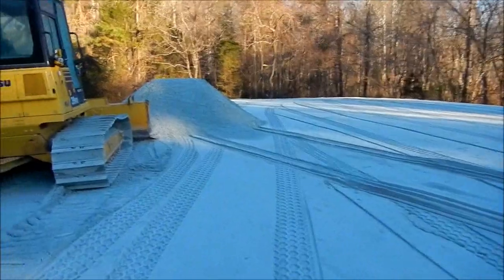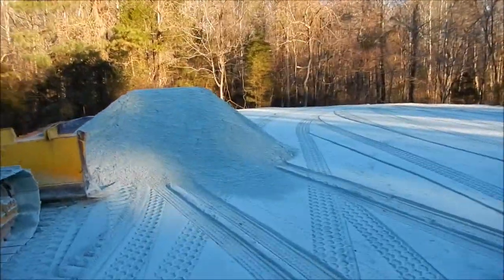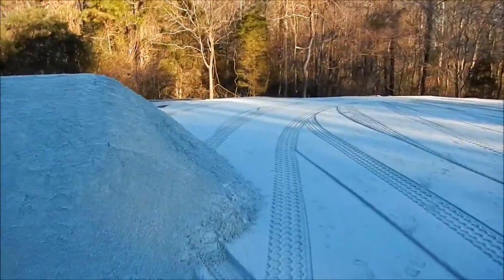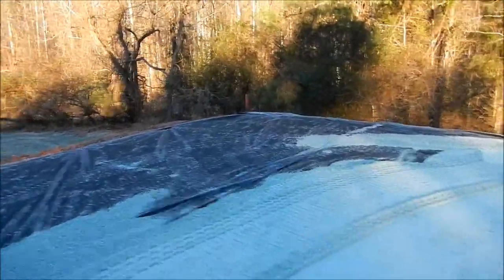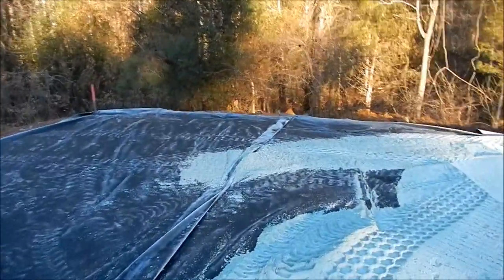And today we got 80 tons of, this is like almost a little over 500 tons of screenings we put down. I got 80 tons of sand coming this morning. They can only get 2 loads a day per truck because it's like a 160-mile round trip to go get it. So I got to finish filling in this corner right here, spread it out, get it compacted in.